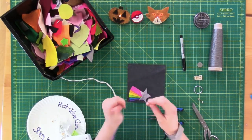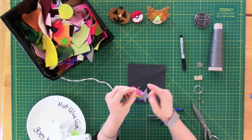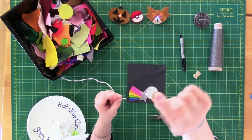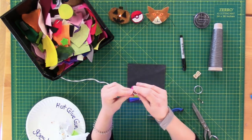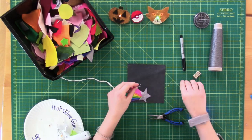Next, let's move on to our LED. You'll notice my LED has two legs, one longer than the other. This long leg is the positive end of our LED and ultimately needs to be attached to the positive end of our battery pack. The same goes for the negative end of the LED and the negative end of the battery pack. To give you an example of how this works and also test our battery, slide the coin battery between the LED prongs — the plus side of the battery touches the longer leg and the underside of the battery touches the shorter leg. Your LED should light up.